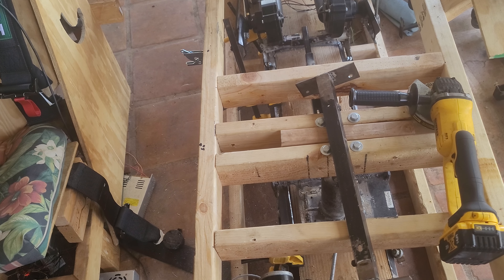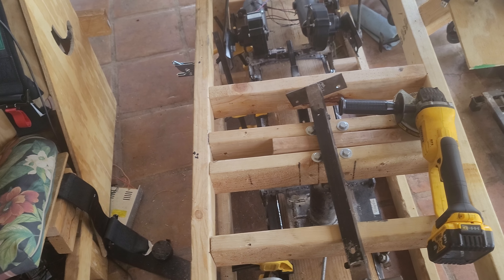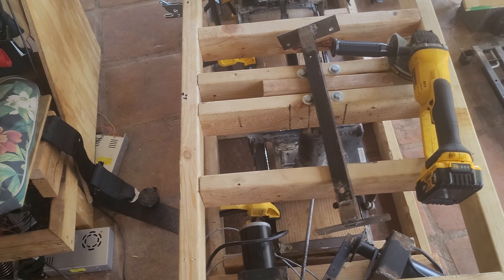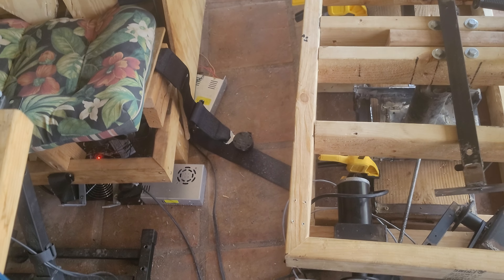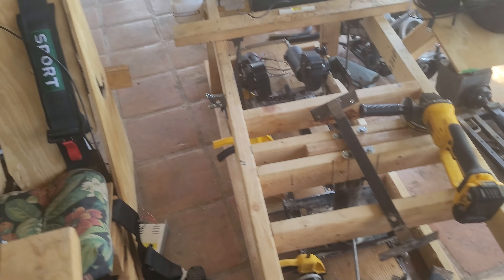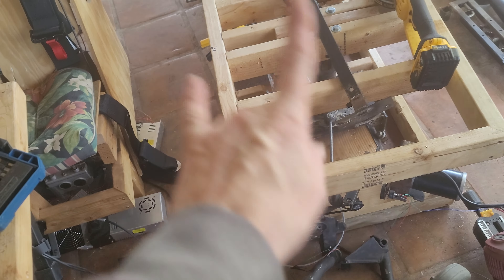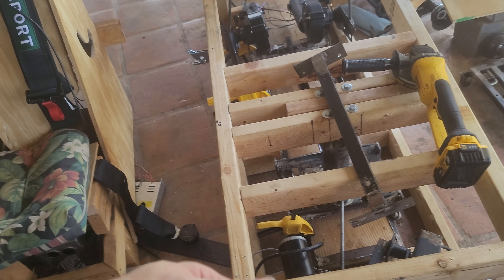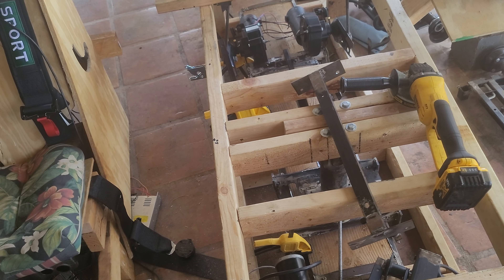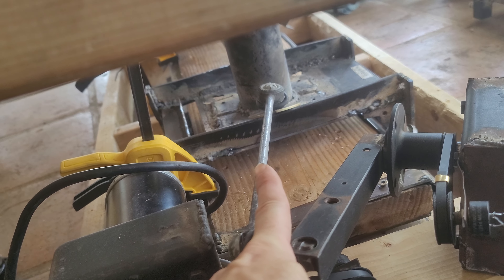I had the rails built to that, but then I noticed the rails were — since there are three separate box sections welded together — just terrible. I'm just terrible at welding, and this fabrication requires a lot more precision and tools, like an actual welding table. I'm doing most of this off tile flooring, which is not straight. So I had to take the rails apart completely, took the most warped rail off, shaved it off completely, re-welded it, pounded it into shape, and then re-welded the top section. It was looking pretty good.